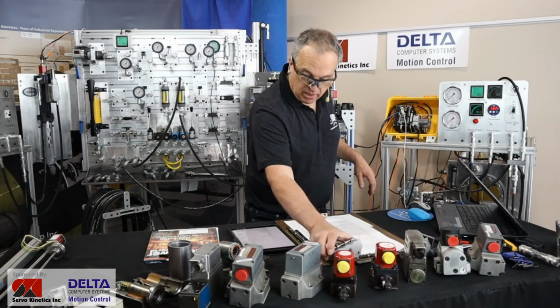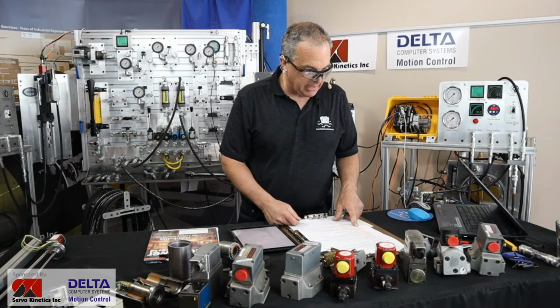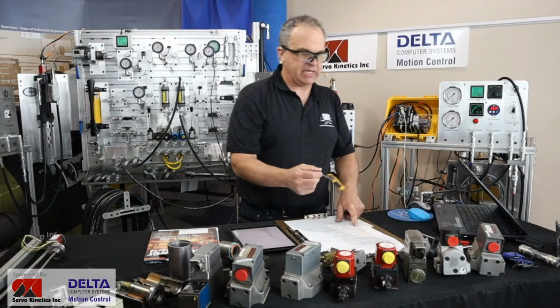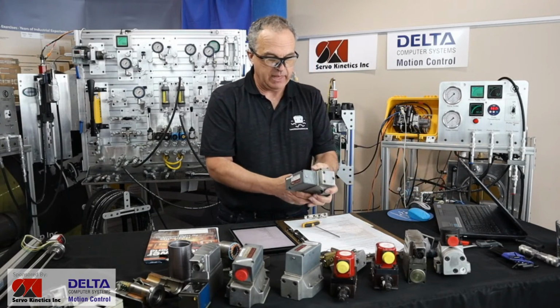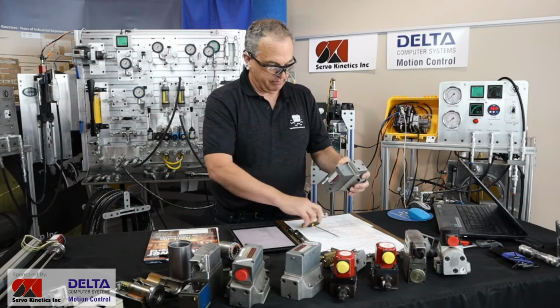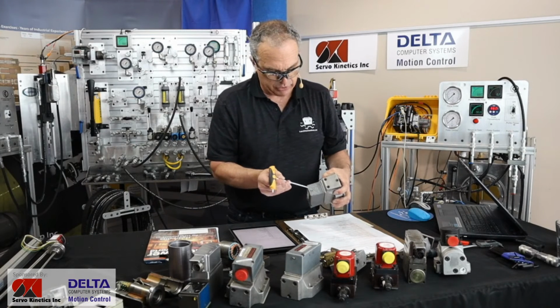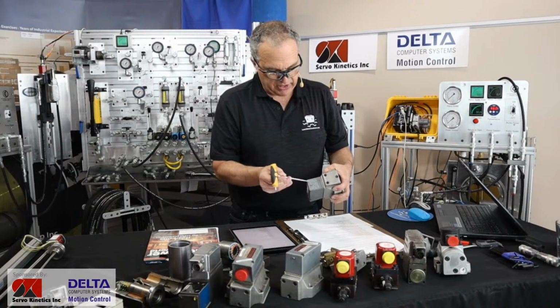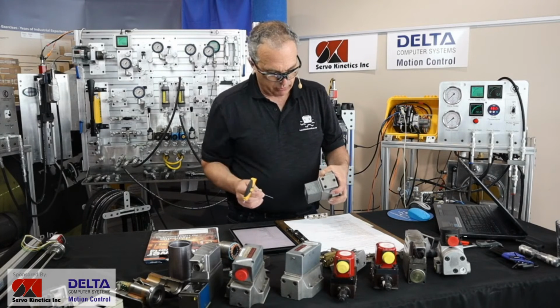All right, we are now going to do some live work on the hydraulics once again, and I promised you that we would take that screw out of the valve. Actually, on a lot of the Moog valves that I've got here, instead of having to take out that screw above the connector, the later models sometimes just had an adapter hex key piece that would connect to the nulling feature, and we'd come out the back.